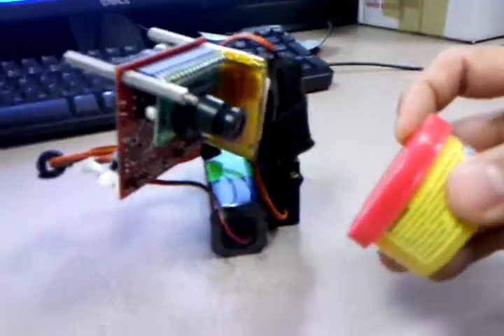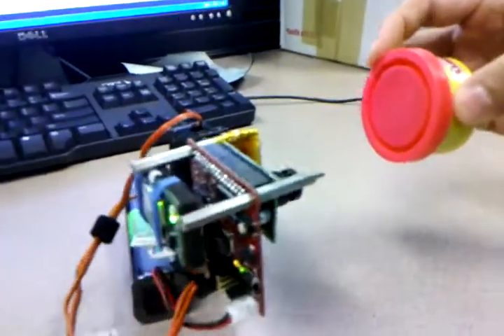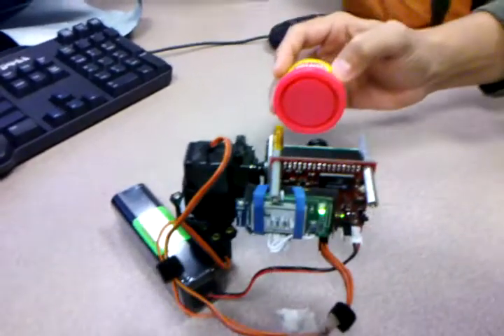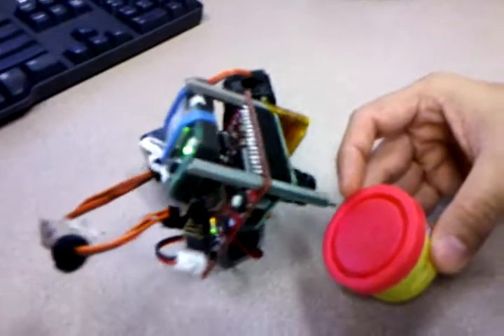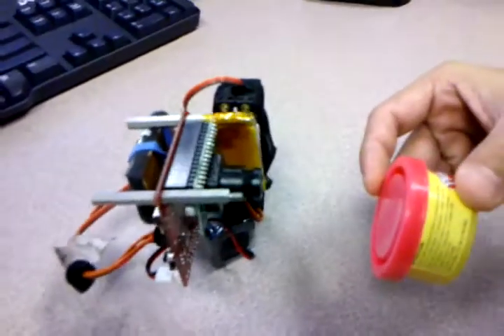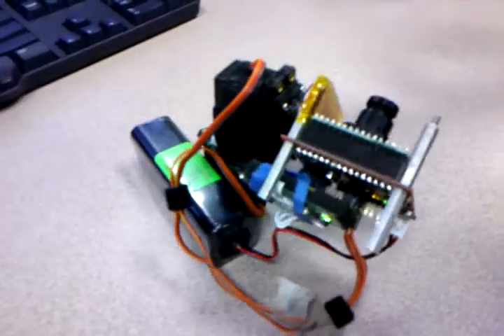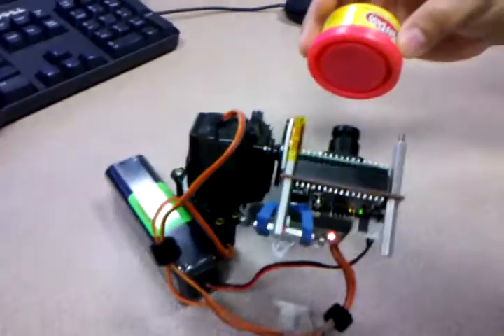We're doing low resolution and capturing red pixel values using threshold values. We're using RGB 0 to 255 resolution on each filter, with a threshold of 100 to 255 on red, 0 to 30 on green, and 0 to 30 on blue. If it meets these values, it logs it as a red pixel, creates a red pixel mass value, and computes a centroid. A perfect centroid would be 88-71, which is perfect center. If it's anywhere out of bounds from the centroid, it commands the pan-tilt mechanism to move in that direction.